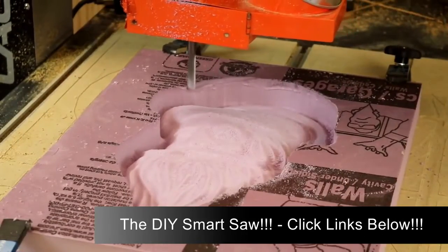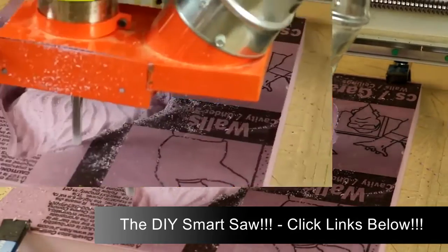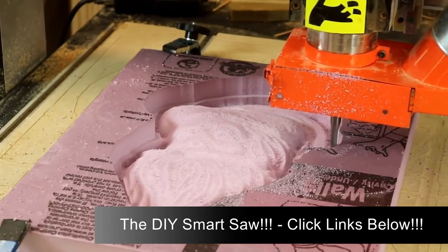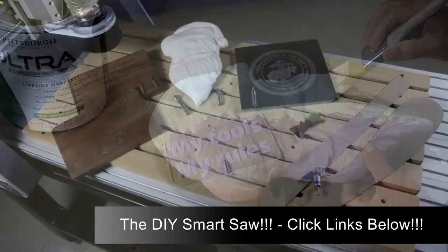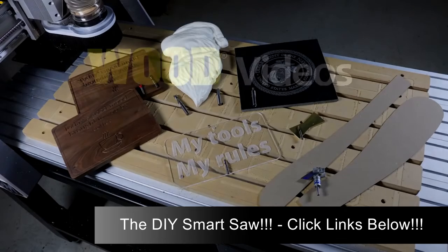The final outside shape is being cut with a half inch end mill — the same bit used for the roughing pass. I'll leave tabs behind again to bridge the work piece to the frame. A little bit of latex paint and we're good to go. Like driving your car, speed limits aren't just a suggestion — they're the law. When you're running your CNC router, you've got to pay attention to feeds and speeds to get everything to work properly.